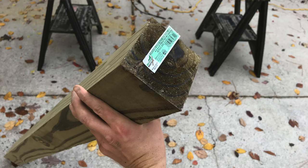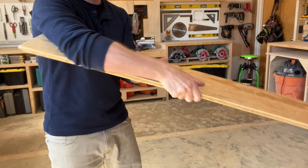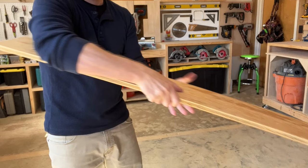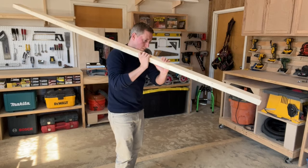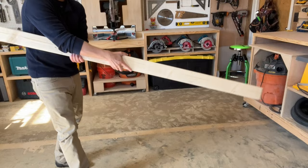I was on a deck crew once, passing a four-by-four down a cutting table to a co-worker. He let it slide through his hands and a four-inch sliver broke off in his palm — it was more like a shiv than a splinter, and pulling it out was messy. Whether you're carrying lumber or having it handed to you, move it with firm handholds. Never slide. Release with one hand, reposition and grab firmly, move the piece, and repeat. Don't slide it down your shoulder either — hop it down. This reduces how deep a splinter can get driven in and forces you to handle the board more securely, like a rock climber, one hand grip at a time.